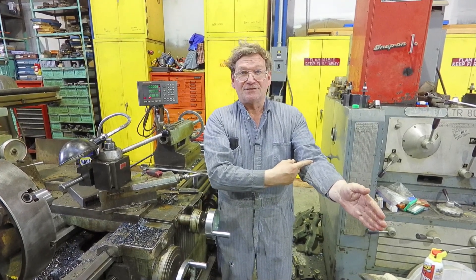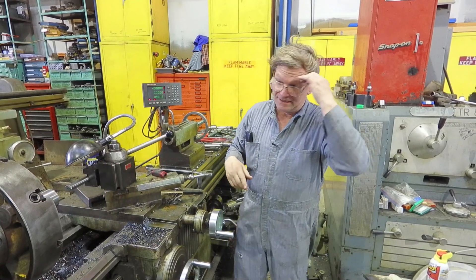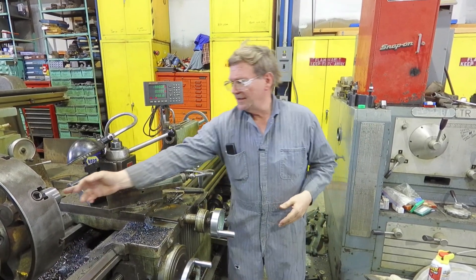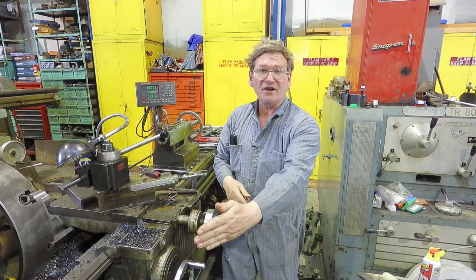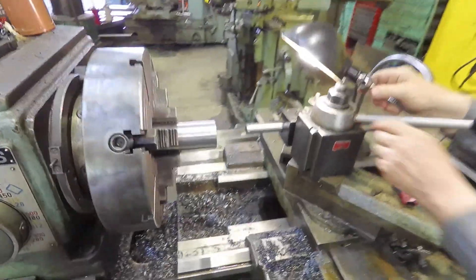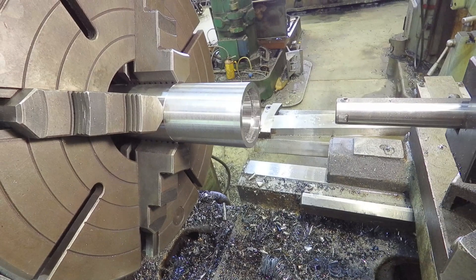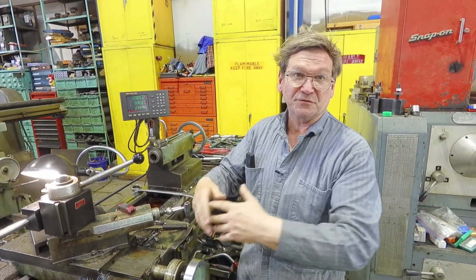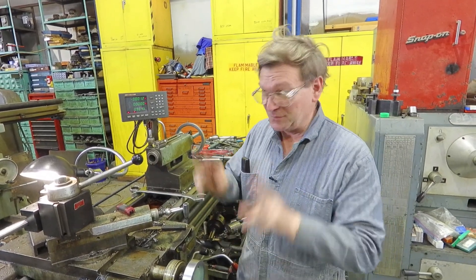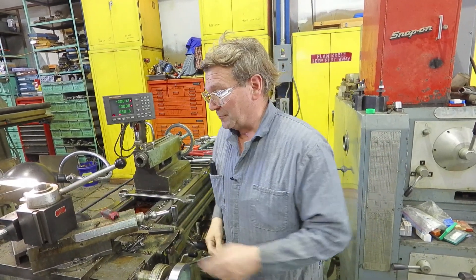We're going to put the thread in from the inside as well — I didn't want to set it up twice. The taper for the thread could have been cut in the other direction, pushing it out, and it would have maybe had a little bit of waviness, not quite as pretty a finish. When you cut the thread on these, you leave a flat on the top — you're not letting it come up to a sharp V. There's clearance in there because there's going to be dirt and different things.